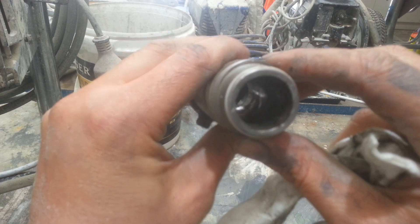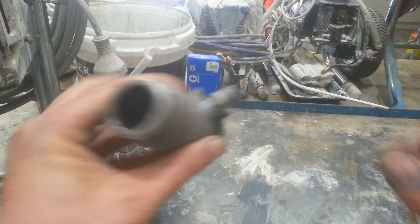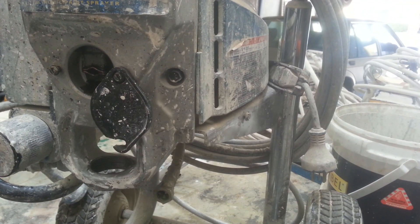So this is pretty much a full pump replacement or rebuild. If I was to just go ahead and replace the packings I would get it to work, but only for a very short amount of time before it completely did it again. There's a little demonstration of how to disassemble a pump and how to inspect your components. Ali from West Bray Elvis — until the next one, take care.